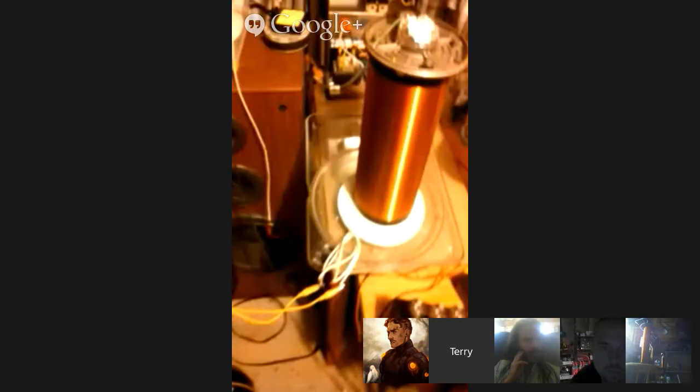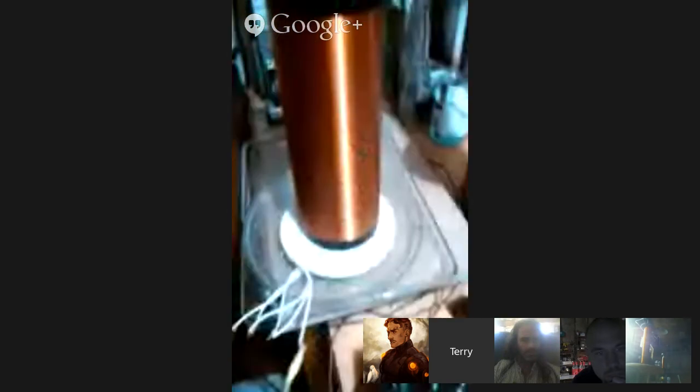This is the same as your primary. This is the step down. It steps down this high frequency, high voltage to a low voltage, high frequency. That's why it's capable of running a flyback simply by connecting it. No rectification. Right, it puts out high voltage on the flyback. So you could easily charge your run battery with the output from this step-down transformer. That's basically what you're saying, and you did in your video, which is how I saw your video not that long ago.